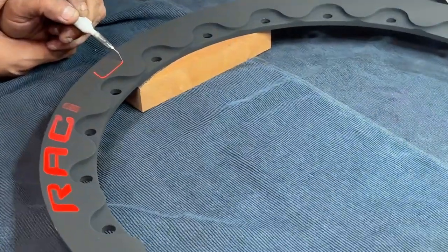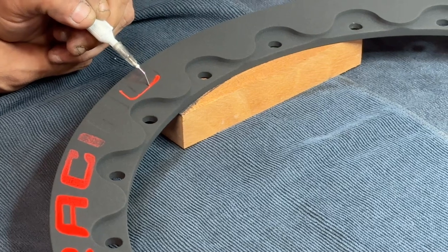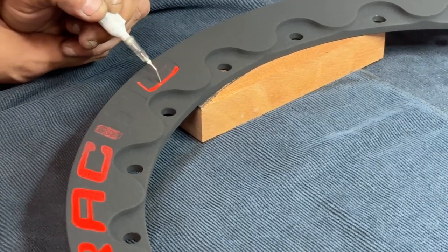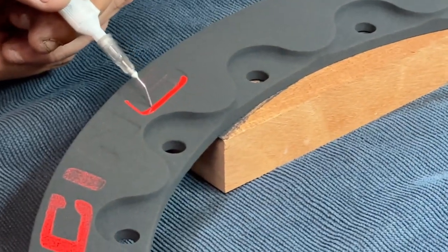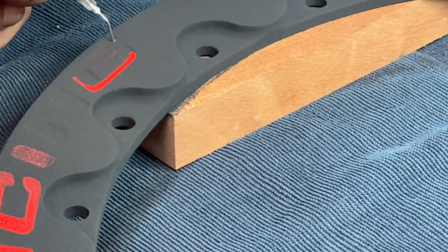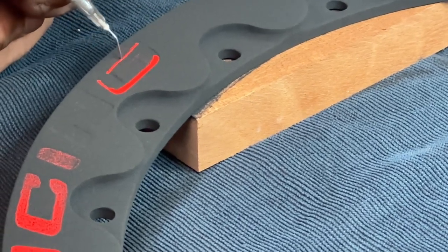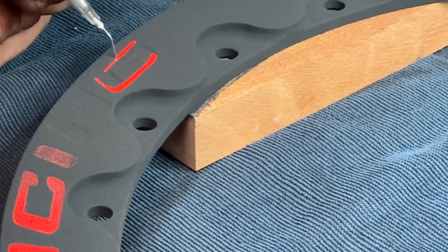The next step is to apply the secondary color in powder form, then the tedious part of vacuuming out the areas where you don't want the top coat color. This can go wrong really quickly — if that little micro tip comes out of the groove you basically have to blow off all the powder, reapply it, and restart the process. So when you're paying somebody to do two-tone wheels, understand this is where the pricing goes up, because this is a very difficult task to do and make it look good at the end.